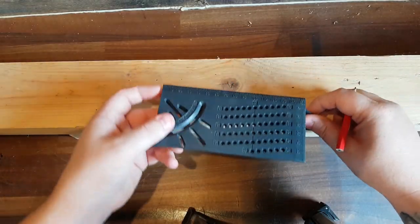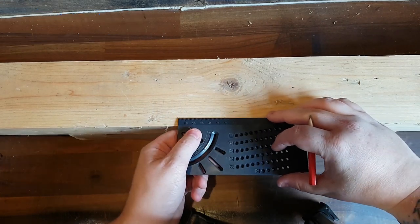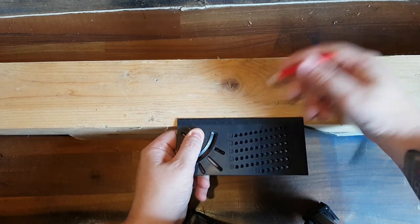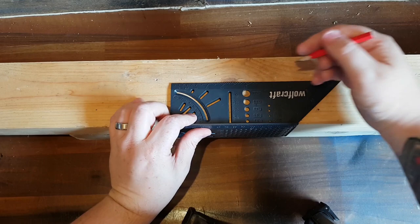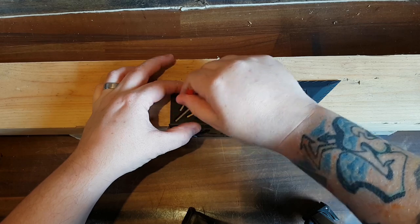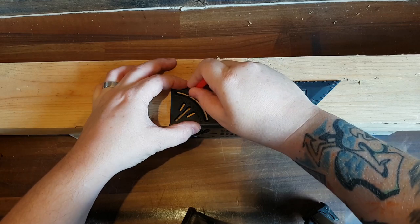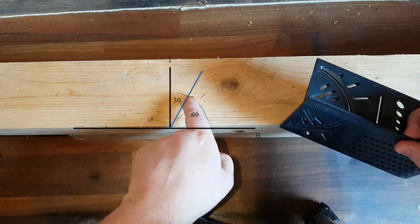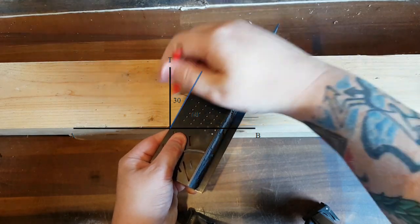Let's do some marking out and see how we get on. The first thing I like is this edge along here — you can put it up against the mark and come down, say, all the way to 100 or whatever you want. You can also put it this way and do your angles — so you could draw a radius, or this would be your 45 degree angle. For a 30 degree angle, you put your mark here, and the line between those two points is 30 degrees. You just put your edge along and draw out your 30 degrees.